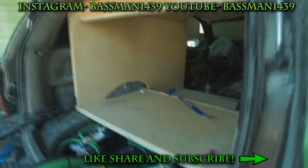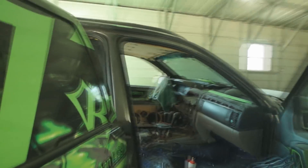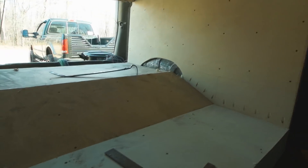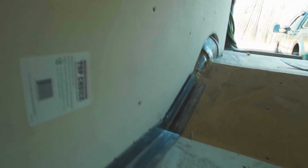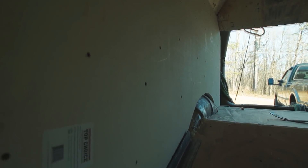Picking up from the last update, I've pretty much got the floor built. I added a second piece of three-quarter inch birch to the sides and brought that down. As you can see here, I'm starting on some angle iron to tie the bracing in from the floor to the sides, and I'm going to get the ribs done with some squared tubing.